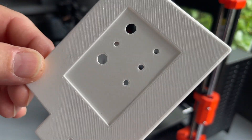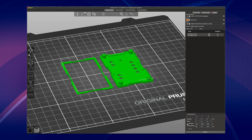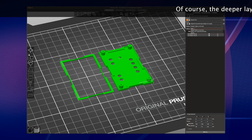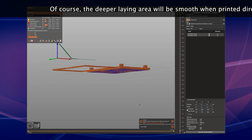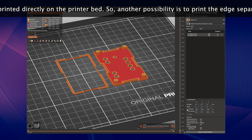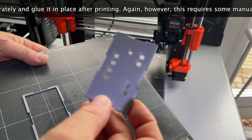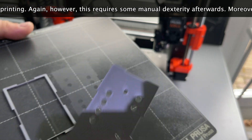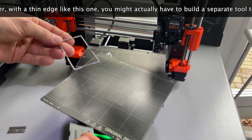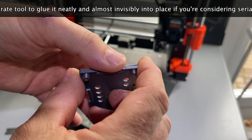The big advantage here is that the recessed part is flat on both sides. With the smaller case shown earlier, however, there are four screw legs behind the recessed part. Therefore I tried another approach: in the slicing software I cut the lid in half, so I could print the protruding edge separately. This also allowed the recessed part to be printed directly on the printer bed. The idea was to glue it onto the front later. Fast forward — the front side looks perfectly smooth. Now this has to be glued on for each lid you print, which is a bit of post-processing and might be visible in the end.